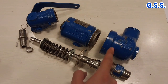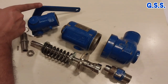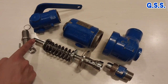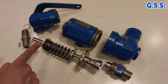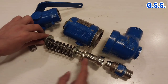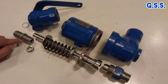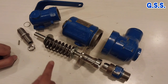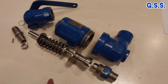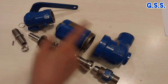If the safety valve is of carbon steel, then this angular body, bonnet, and cap, and this lever are of carbon steel, ASTM A216 grade WCB. The internals — that means this stem, this upper spring washer or plate, lower spring plate, this guide plate, this disc, and this nozzle and orifice, this adjusting screw — everything is of stainless steel, and the spring is of stainless steel or Inconel. If the safety valve is of stainless steel, then this body, bonnet, cap, and all internals — everything is of stainless steel.